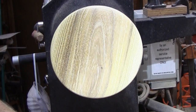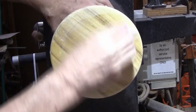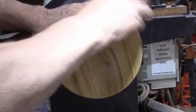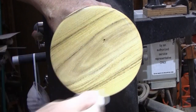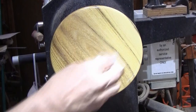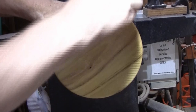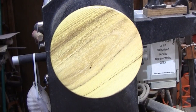I like to soak it in really good on that first coat. Really all I do is wipe it on, like you would a wipe-on poly. This stuff doesn't have an odor. I get it on like that, and I like to finish it off with the lathe running really slow. Okay, so there's the first coat. I'll get another one like that, lightly sand it, and I'll be back and we'll put the first coat of polycrylic on it.